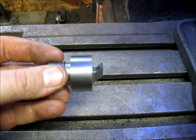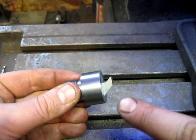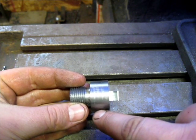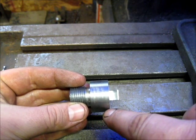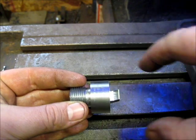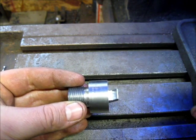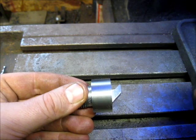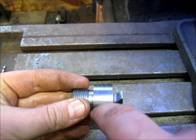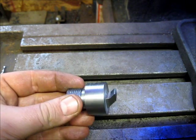That's how it's done and what it looks like when finished. If I was doing flintlock double rifles, I'd machine a flat in here at a slight angle — that's called a recess breech. That allows a narrower width through the wrist section because it tips the locks in a little bit, moves them closer to the center line, giving a thinner wrist. But since this is going to be a cap-lock, I'll have to machine a flat and drill and tap for the nipple.